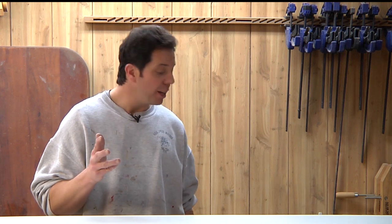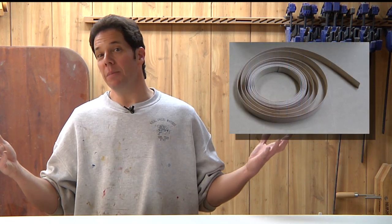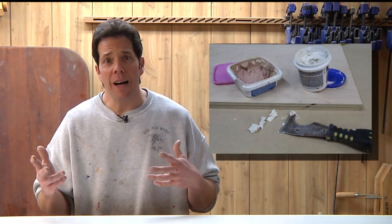In the past what I used to do was use some edge banding, but on big projects that can get expensive. So then I was using wood putty or drywall compound spackle, and that did a great job. You'd have to put a couple of coats on and sand it, but when it was done it took the paint and left a nice smooth finish.